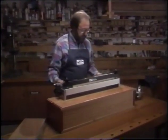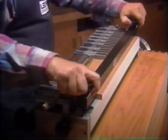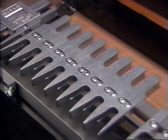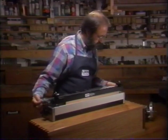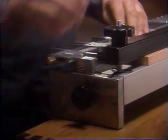To start, insert a spacer board under the guide fingers and clamp it down with the rear clamp. Your spacer board should be approximately three-quarters of an inch thick by six inches wide and long enough to fit your jig. The spacer board provides a flat, stable platform for the adjustable fingers. Begin work with the finger assembly in the through dovetail pin mode. Set the scales at approximately the central position. In the TD pin mode, the adjusting screws will be facing up and the angled end of the fingers will be toward you. Lower the finger assembly down onto the spacer board and lock the support bracket knobs.